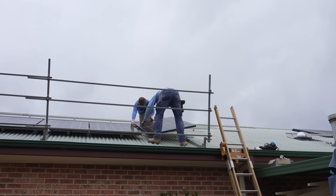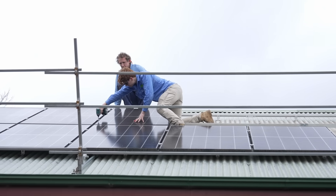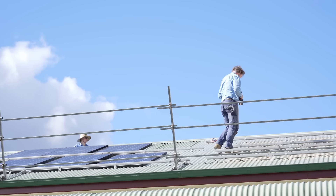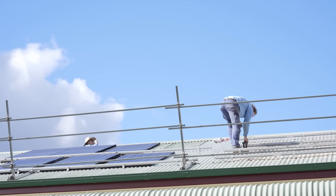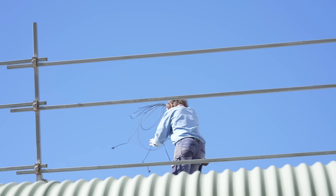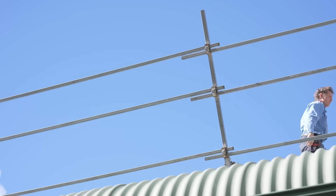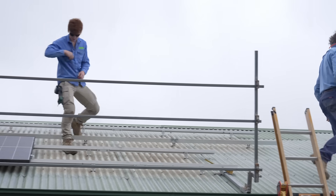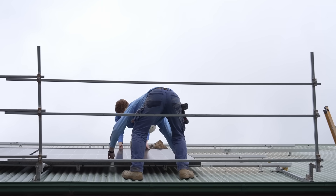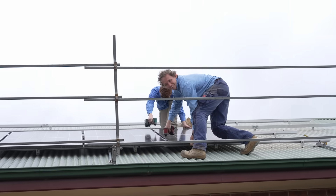The interesting thing is most installers didn't really want to touch that - they didn't want to do the work. As a result of what I wanted, they had to remove the existing panels. They're only a couple of years old - they've got SolarEdge optimizers on Trina panels - and they had to delete the optimizers and then restring. I'm really happy with what they did because when they put these panels back in and linked them all up, Ezra and Samuel found a few things that the previous installers had taken shortcuts on. So they took the time, put it back together really well, and even did things like deleting the excess rail sticking out the sides. It looks really good. I'm really happy with the way it looks and really appreciate their attention to detail.